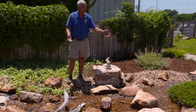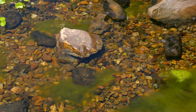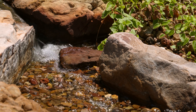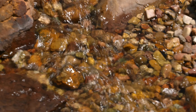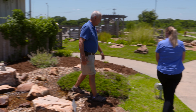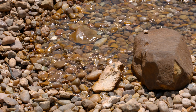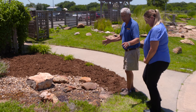Here's a simple way to fill in a lot of space all along your waterfall - simply by raising the rubber liner up and poking dirt underneath it so that you've changed the height, and the water is forced to go this way and not flow out into the yard. The rest of these rocks we've added just to add interest. If you make water wide, it's shallower and appears to be slower, moving at the same volume. But if you pinch it together between two rocks, it's deeper and looks faster - it makes rapids, white water rapids. We've got our largest one that shows where you can narrow it down and it really turns up some white water.